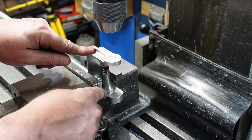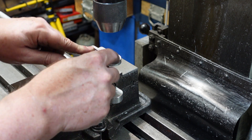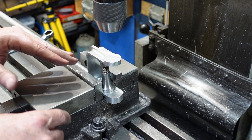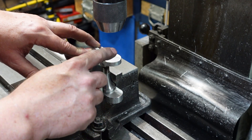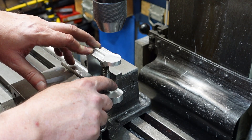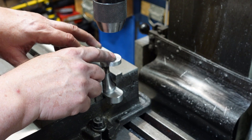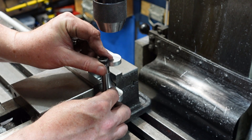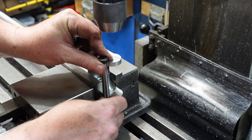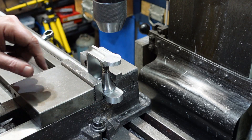I've also got a jack in here because I'm a little bit concerned that if I apply too much pressure this might bend and give me a crooked hole. So I'll go down here with a tapping drill — I think I've got one that will just reach long enough — and I can put that hole in there, then come back and take that hole out to diameter 10. That one doesn't matter quite so much but I do want those two holes aligned, so I'm better off doing them in the one setup.